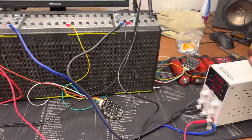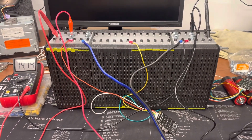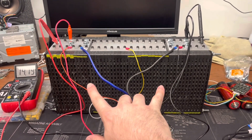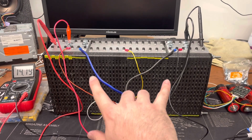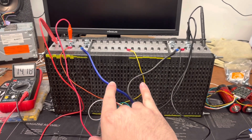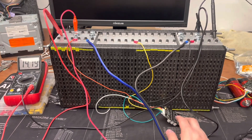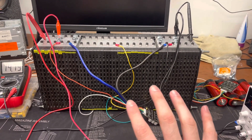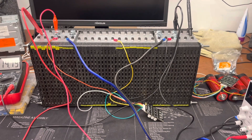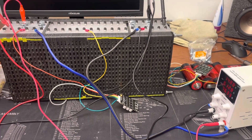This is a 5-amp balancer and 5-amp charger. I don't have to worry about one bank charging faster than the others. The outer banks usually get more voltage than the inner ones. Having the balancer on it - I'll probably never disconnect this - having the balancer on there will keep all those cells even. Shouldn't have to worry about anything.